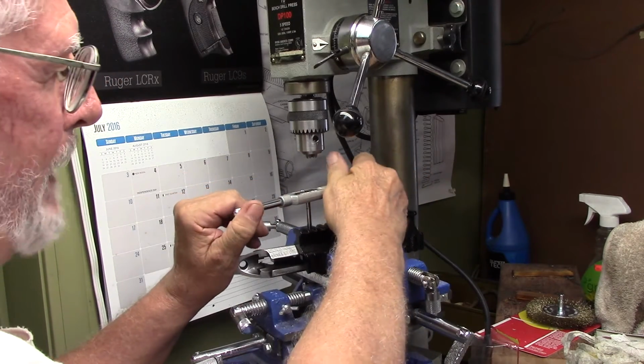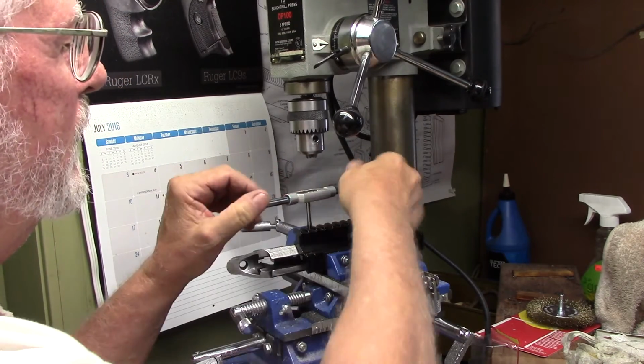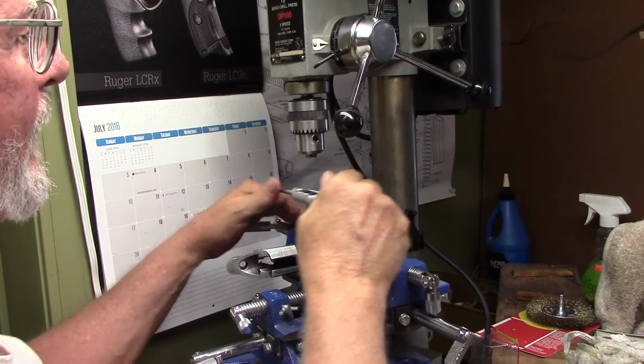Like I said, if you hear any tap tap tap chatter, back off. Be very careful. That's the point where it's going to break.